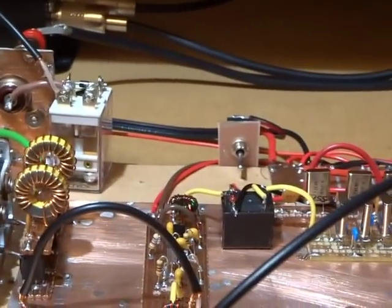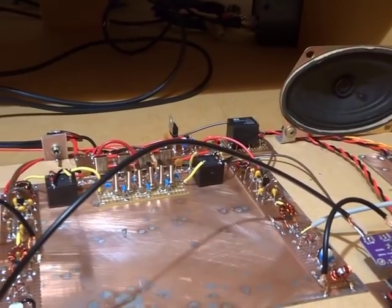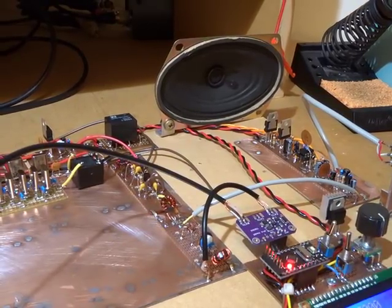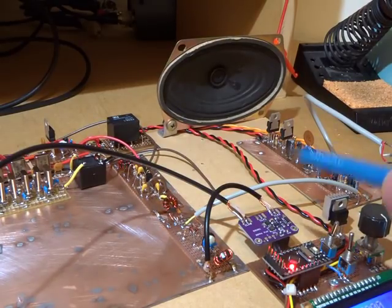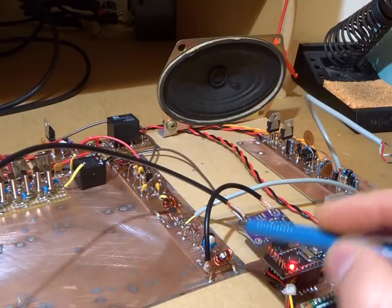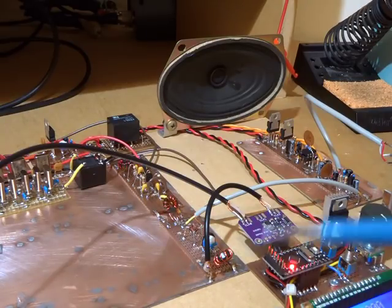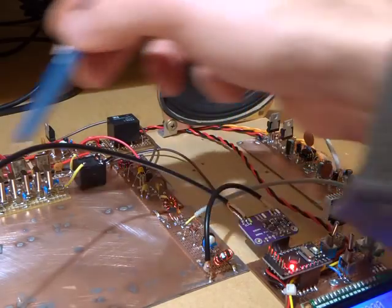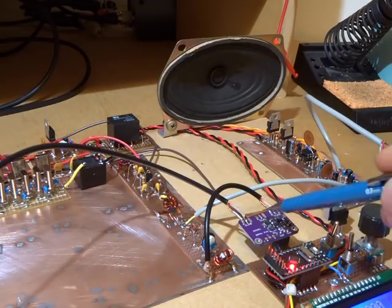In terms of the Plessey amplifiers, I'm not going to do any more on those, so I think I'll now just turn my attention to thinking about the PTT circuit and turning this into a transmitter. And like I say, the initial thinking, certainly for CW, is to take clock one out, filter that, turn that into a nice sine wave, and then feed that into an amplifier chain, and out as a discrete frequency, as opposed to using an older technique of feeding it back through the IF chain. I don't think I'll do that as an audio frequency. So I think I might do it that way.